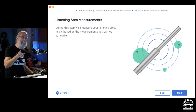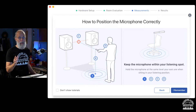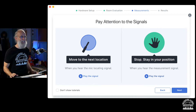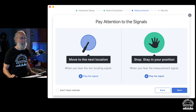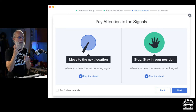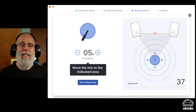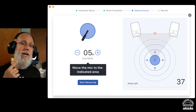During this step they measure the listening area — this is where it gets really interesting. It's a long process and you'll see me doing a kind of dance with the microphone, moving around the room to all the different measurement spots. It plays a locating signal to position the mic within a circle, then plays the test signal — the space invaders sound — which sweeps from very low to high frequency and measures the response at each position. I'm putting on earmuffs because it's about to get loud for 20 minutes, so put in earplugs before doing this test.